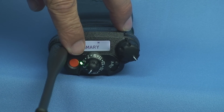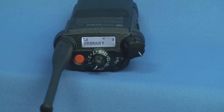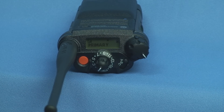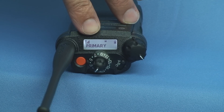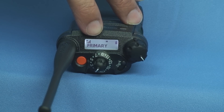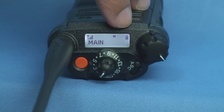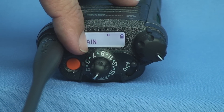When you first turn the radio on, you're going to see it flash green, and then it will flash red twice. That tells you that it's connected to the system. You don't want to try and talk on the radio until you've seen that happen — if you turn it on and try to talk immediately, you're going to cut off the beginning of your message. The top screen will toggle between your zone, which is primary — that used to be our A-zone, now it's called the primary zone — and our main talk group. It also gives your signal strength indicator, much like your cell phone, and it gives your battery indicator. So you get a lot of information off this little screen without having to take your radio out of the holster.